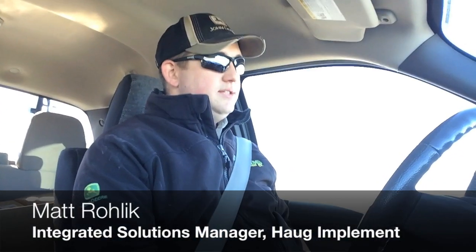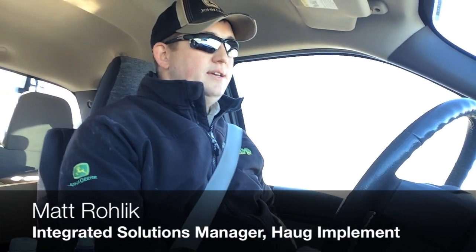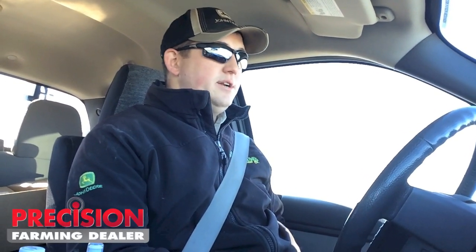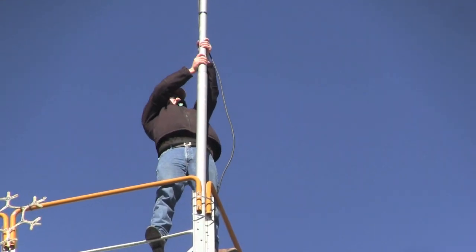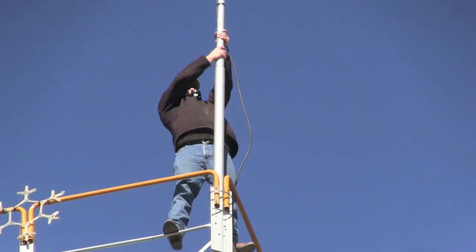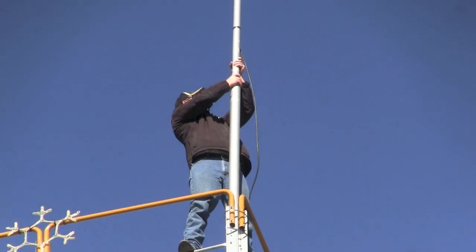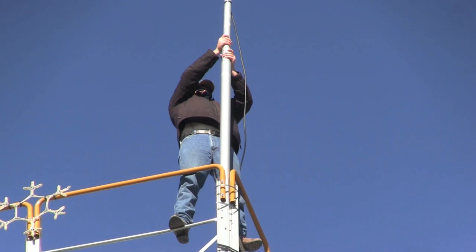On this RTK tower we had a high antenna reflective value, and when we checked it we still had the same problem we did the other day. We brought another antenna up to the top, plugged that in, and that did not take care of the problem. So we had another cable to go from the radio to the antenna, and when we tested that, that was actually the problem.